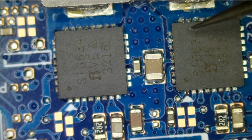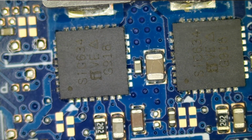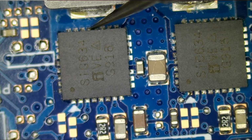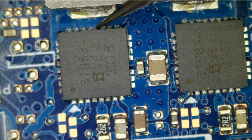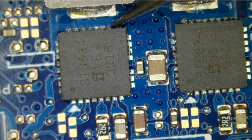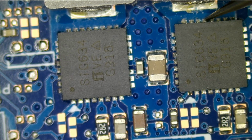Meter in diode mode again. Let me go to ohms mode and measure here. And what do we get? We do not have a dead short, we have 6 ohms. We have 4.7 ohms.